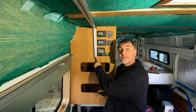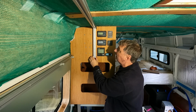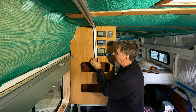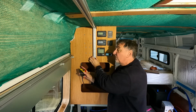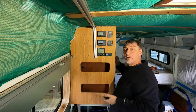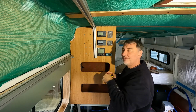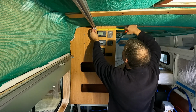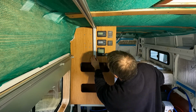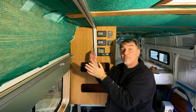You can probably see now that one piece is bolted into place, that's not exactly at the angle that we want it. It needs to be over here slightly, like so. There is enough flex in this top beam to achieve that, but what we need to do is bend that into place where we want it in order then to mark the length that we need to create the bottom section. We know that this is perfectly vertical, so we can measure from here to here to get this angle exactly right. At that point, I can draw a pencil line and I can now remove this section.